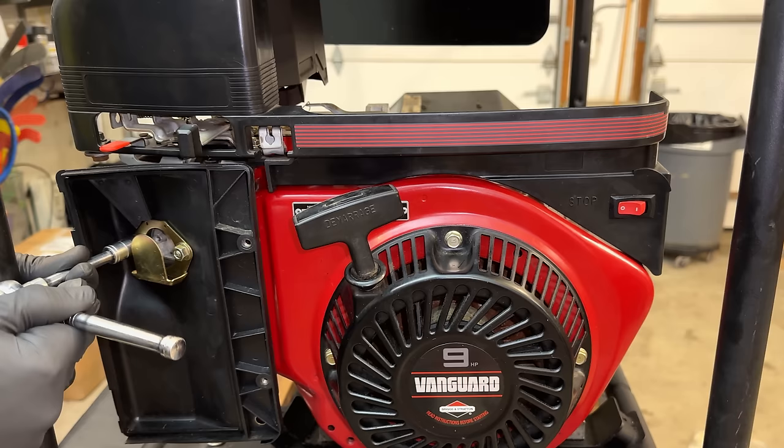All right, let's give this thing a try. Have the external tank plumbed into the clone carburetor with the OEM jet. Now, this model, it is the exact same one as the two we tested last week. And if you remember back, those tested very well. Under a full load of 5,000 watts, the THD only came up to 5.5%. So I'm expecting the same of this one.